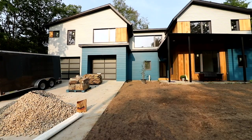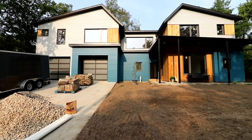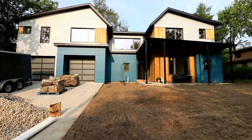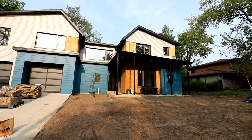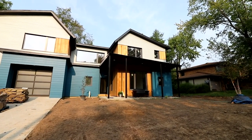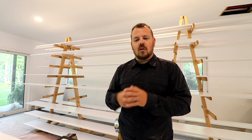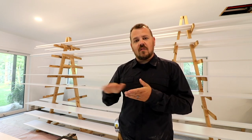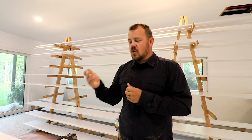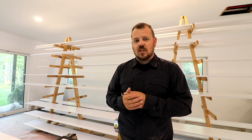A couple of bonus items: we stepped the two 14-foot-wide patio doors, the front and back door, and the door to the garage. Because the plate sits six inches lower than the slab, I was able to lower them in elevation and make everything zero entry. You wouldn't notice anything is different about this house unless you were here during construction.